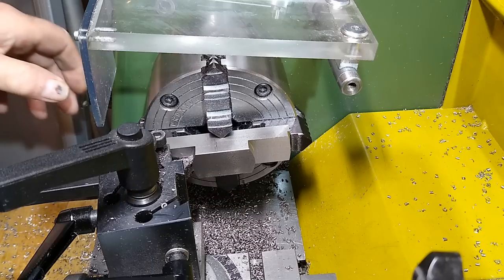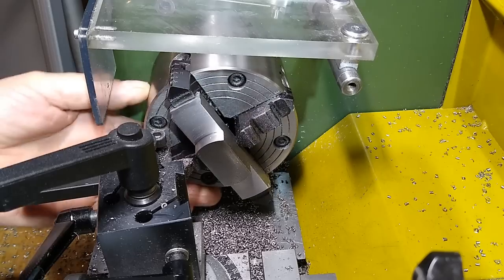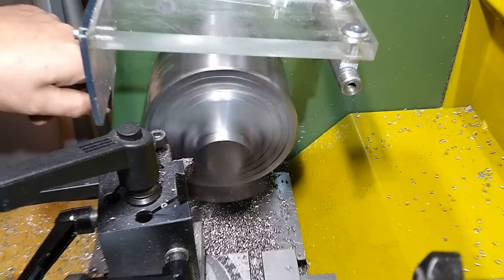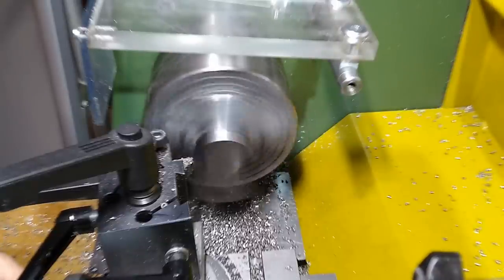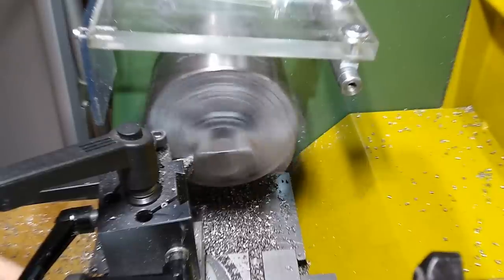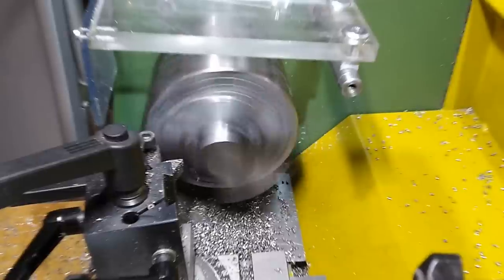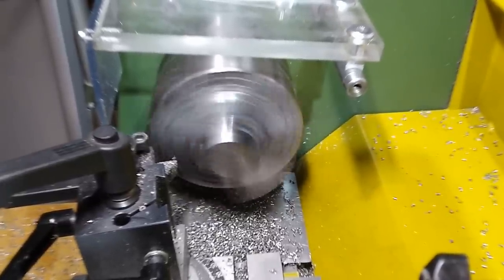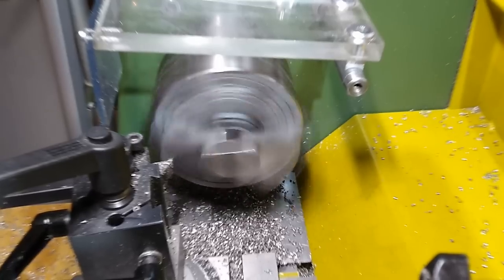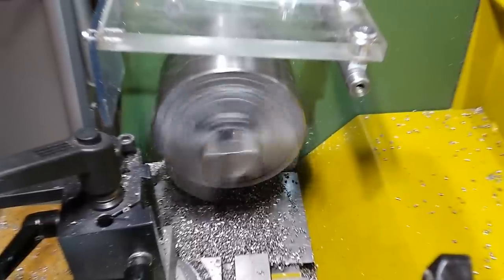The table I'm making later rests on a hinged column, which is dimensioned in such a way that the table edge directly at the grinding wheel does not move when the table is rotated. The gap between the table and the grinding wheel therefore always remains the same width. This column is being made here, where I initially assumed two pieces on either side of the table, but I adjusted that a bit later and soldered both columns together and positioned them in the middle under the table.